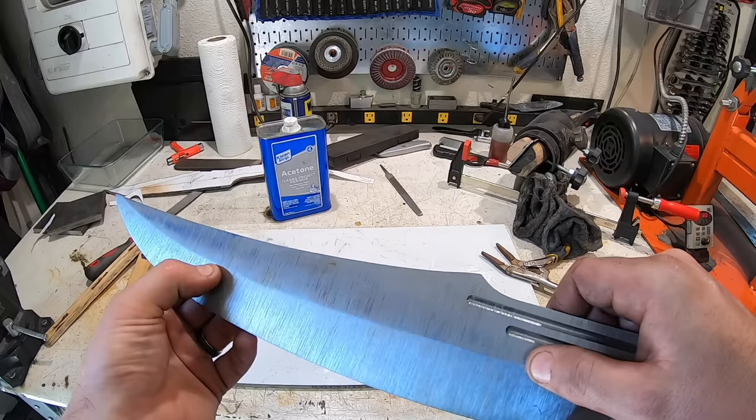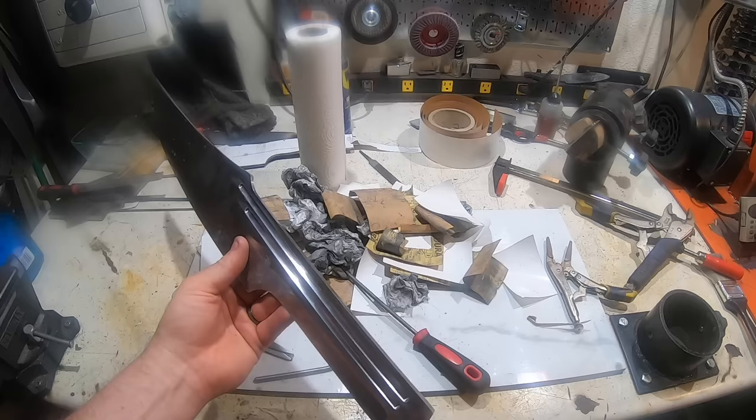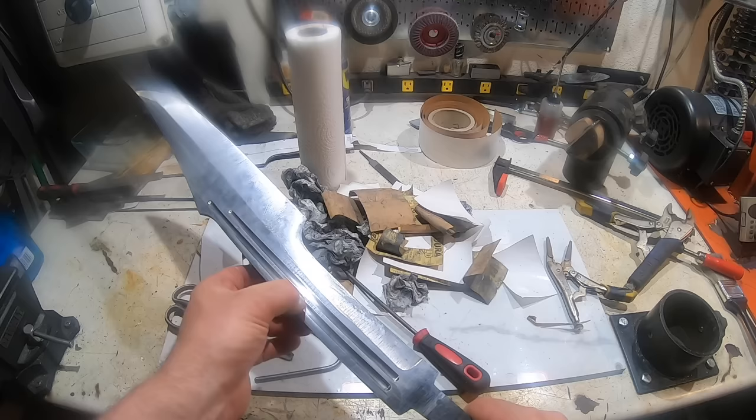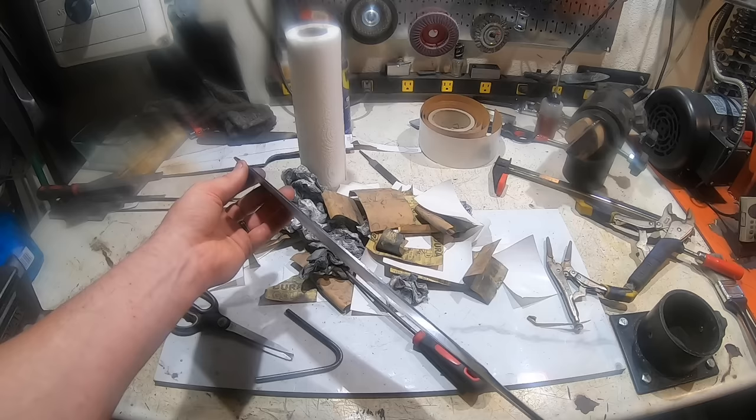So folks, all of this and about 4 hours of time is what it took me to sand out the fullers on this. Because this thing is so large, I couldn't really clamp it well in the vise, so I was getting a lot of chatter, which meant a lot of little grooves that I had to sand out. And I wanted to do that before the heat treat, because it would have just taken twice as long after. So, much better now, and I'm going to do a little bit more grinding just to take some meat out of this, and then off to the quench.